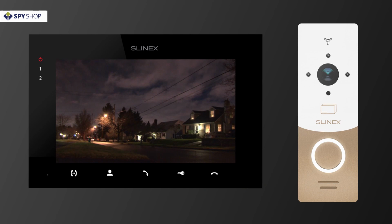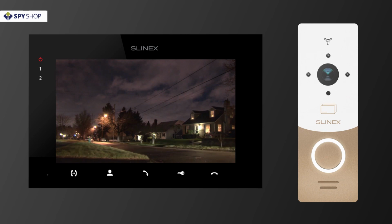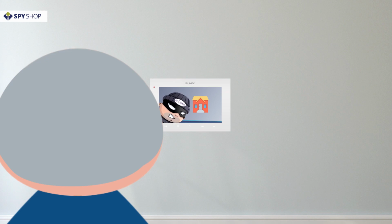When connecting the panel to a DVR or video intercom with the motion detection feature on, a recording will be made permanently or upon detection. It depends on which settings are selected. Thus, you can view anyone who came to the door or just passed by in the video archive. As the panel supports CVBS and AHD, it can be connected to any analog intercoms supporting the given formats, but we recommend connecting it to AHD intercoms.